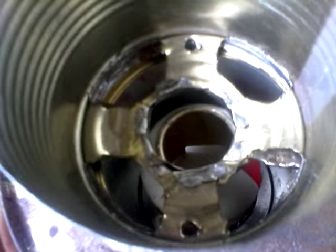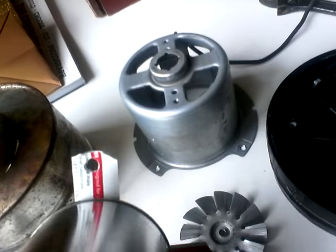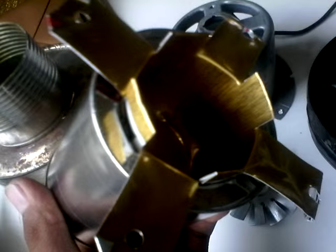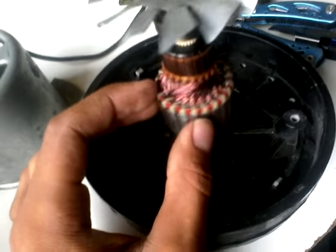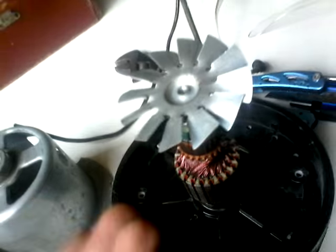The pink can here will be the exhaust — something like that. They're almost the same diameter and align well, though it doesn't look pretty because I cut it quickly. The next thing is to drill holes in the sides. Also, the fan that comes with the vacuum cleaner blows back onto the motor, so I had to flip the blades the other way — they were slanted one direction so I tilted them the other way so that when the impeller is spinning clockwise, this fan will be blowing upward.